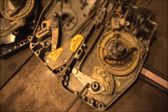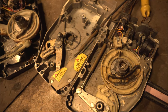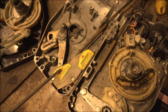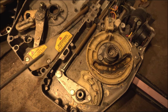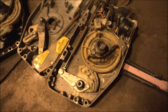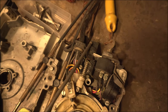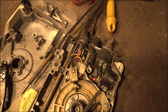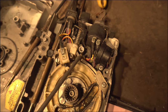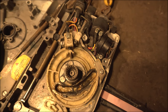The other parts are all pretty simple — just make sure everything is greased up well. It's easy to take apart; unlike many other boat parts, you can take apart this controller in about 10 minutes. The control cables just fit in here — you undo two bolts and they clip right in. There's nothing holding the pin in except that closing both sides of the controller keeps it in place. There's also this little turning knob on the outside that adjusts how hard it is to shift the controller. All it does is tighten a small piece of metal against the center wheel, making it more or less difficult to turn.